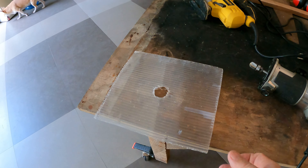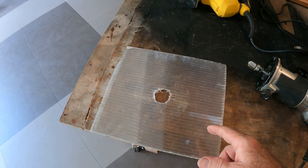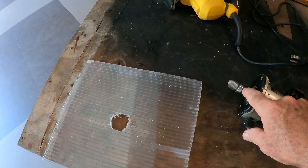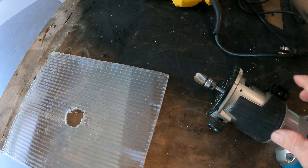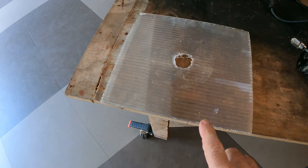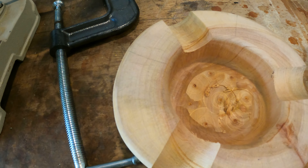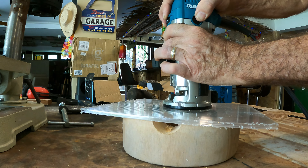Here it is the next morning. I was hoping I could close up a lot of this project last night, but the delivery I was expecting for the two-to-three-inch pneumatic sander to do the sanding of the inside of the bowl — it's on delay, it won't be here for another week or two. So I'm going to have to come up with an alternative way of doing the cleanup of the bottom of the bowl. I took a piece of polycarbonate — leftover from an earlier project — and cut it out a little bit bigger than the size of the cigar ashtray, and I made a hole in the center so I could put the bowl and tray router bit through it. Basically I'll set it at the same level as the corner and let it clean up this space right here. Let's see how that works.